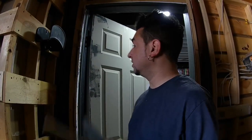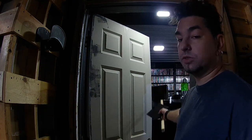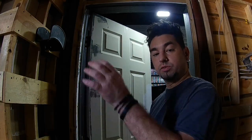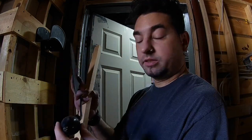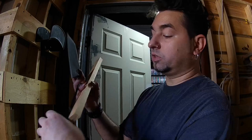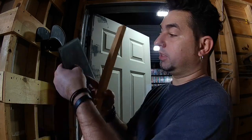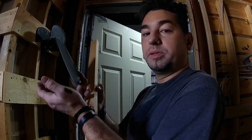What we're going to do now is install the door — put it back on the frame. I changed the hinges and took about a quarter of an inch off the end of the door so I could put the housing over the handle, deadbolt, all that protection. I have this device that's meant for installing doors — you put it in to wedge it a little before screwing it in. You just pump it, it fills up with air like an airbag, and it'll lift or move the door. I'm going to put this underneath the door so it moves the door up a little bit for me.